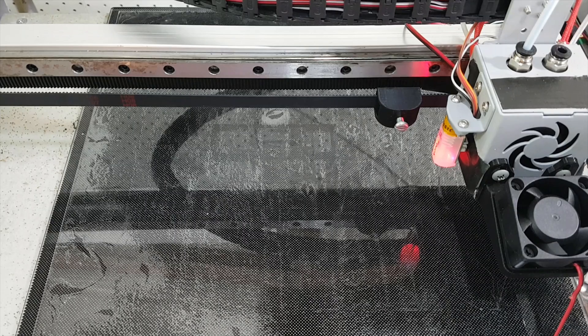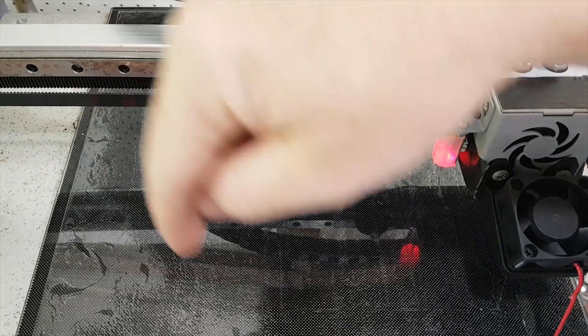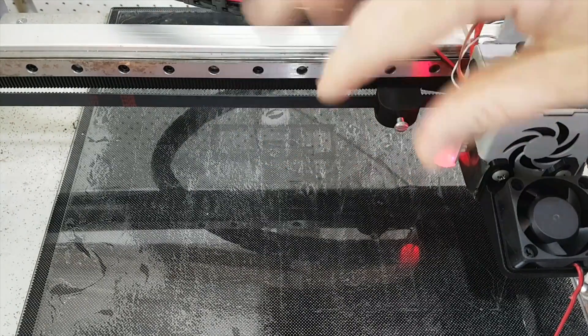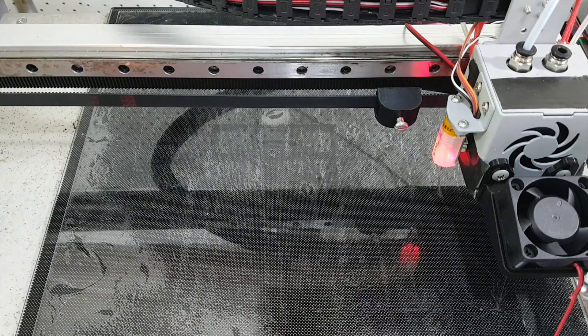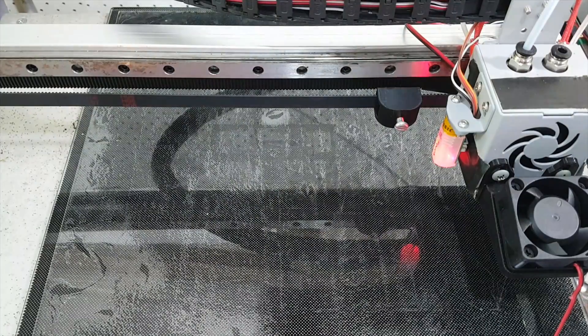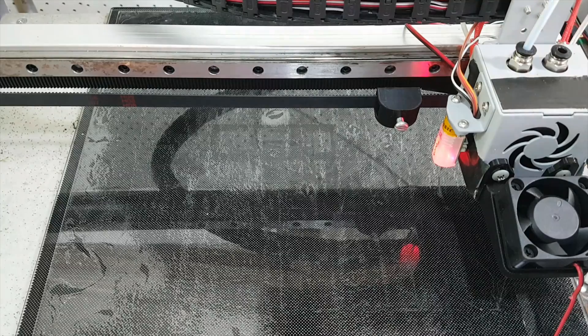That's not even the most annoying thing about the cheap ripoff one. The most annoying thing is that sometimes it can't do the leveling. It'll go through doing some leveling points and then all of a sudden it will just screw up with that flashing. Then it'll just think that whatever height it is is the same for all the rest of the bed, and print an inch away from the bottom — which means it just ends up being useless stringing.